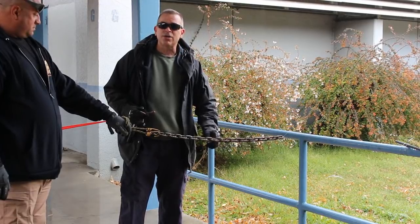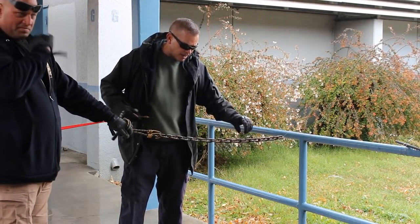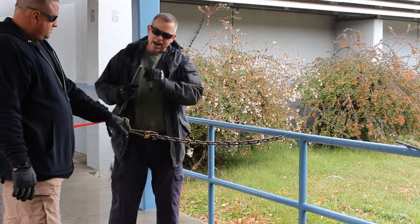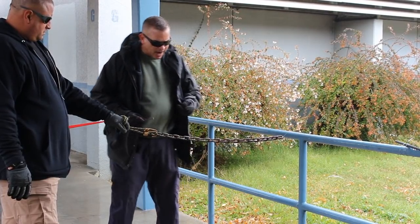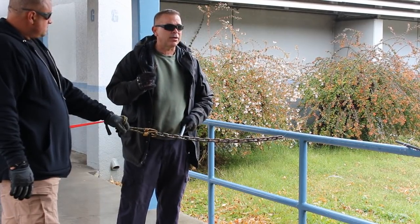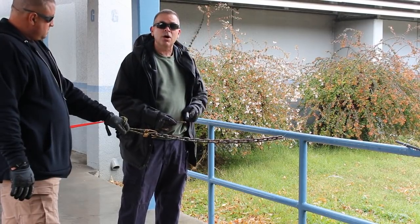I don't have to sever both sides to breach a chain — I just need to get through one side and then unhasp it. When you ignite the rod, it has a red igniter tip. When you strike and light it, you've got to have that tip down and away from yourself. This match burns furiously hot but only for a second or two — touch it right to that igniter tip and it'll get going.